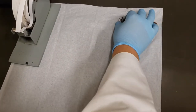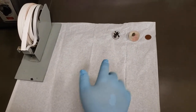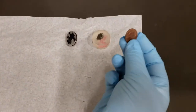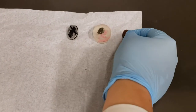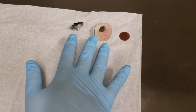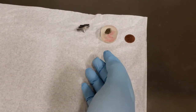For sample prepping for the SEM, you can have pretty much any kind of sample — a powder, fibers, mounted samples that have been polished down, or chunks of material you're trying to analyze. For all of these, we're going to mount them onto a stage, then verify that there's some sort of electrical conductive path from the sample to the stage.